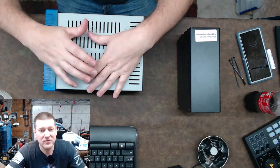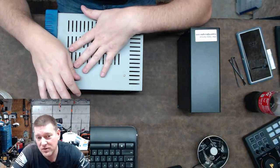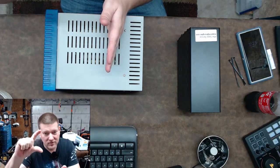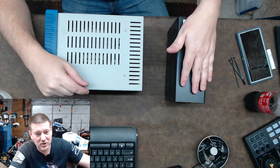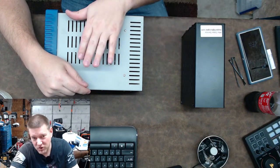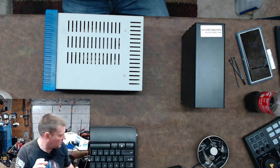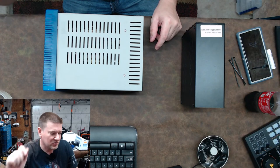There are multiple ways of achieving variable voltage. One way is to use a transformer with multiple taps — you drive it at a certain frequency and voltage and use variable taps to decrease voltage in certain ranges. Or you run high-voltage DC and chop or drive it through a buck converter, which I believe is going on here. One of them is going to be much noisier — that's why the BK would be a laboratory-grade regulated DC power supply, and this one definitely is not.